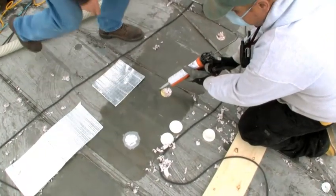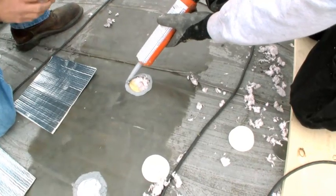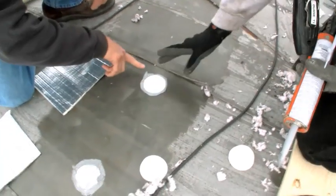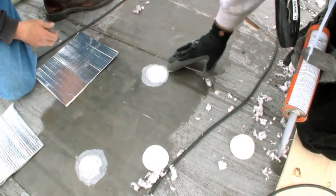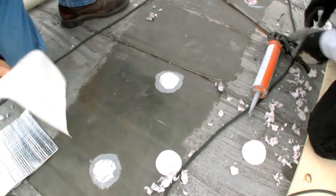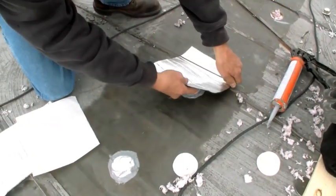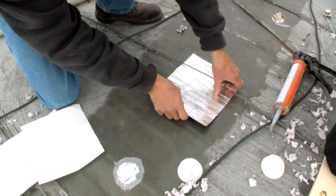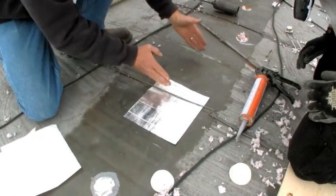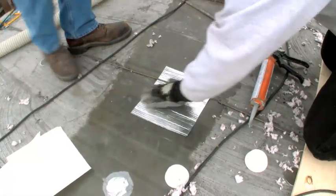What he's going to do here is lay a bead of butyl around the outside of the hole. He takes a two-and-a-half-inch plastic plug, puts it around there, and fingers it around to get a good seal. Then we take the peel-and-seal patch — we use about an eight-by-eight area — get it underneath the area here, trying to stay away from any seams, and get it in between the rafters. Then just lay that on there.